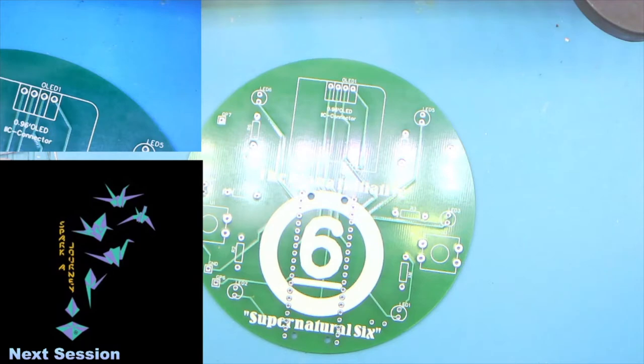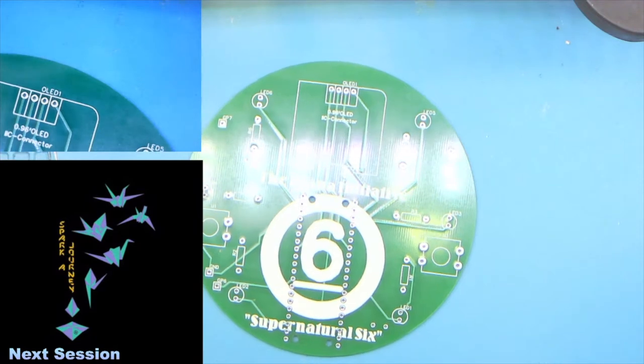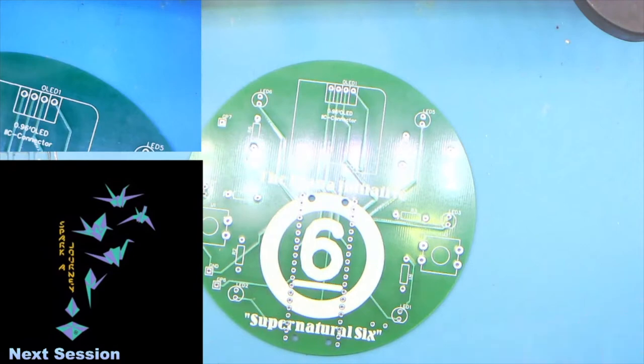I like using what's called a 63-37 mix, which is 37% lead. I know, lead. Lead is one of those weird topics when it comes to hobby electronics. Some people are like, oh my God, no. The reality is that if you read the material safety data sheet for leaded solder, it's going to tell you to not lick your hands, not lick the solder, and wash your hands when you're done. That's pretty much it, and you'll be fine.